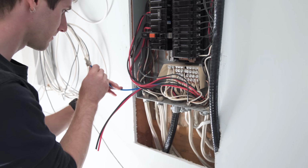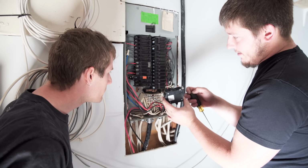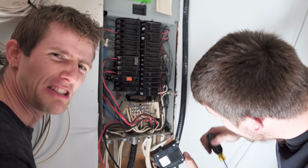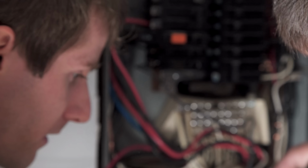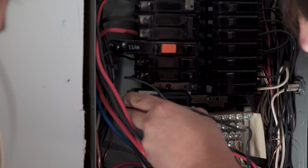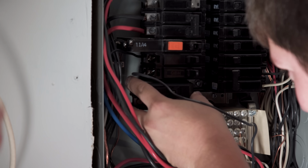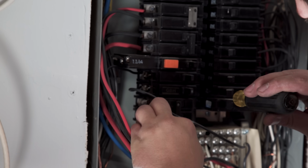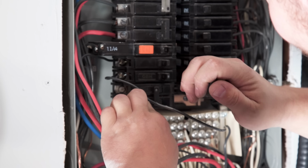And then next we put the breaker in. So how these work, this is actually an old style of breaker. These are called commanders. If you look on the back side of the bus bar here, those little hook kickouts. That goes right in there. Exactly. So this hooks on, make sure the breaker's off because my fingers are on the lugs. So that hooks on. And then these two screws just tighten down into the bus bars. Yeah. Sure, no problem.